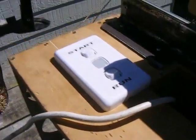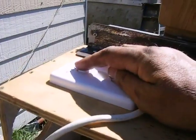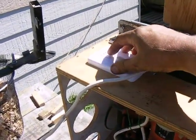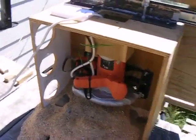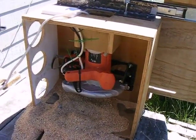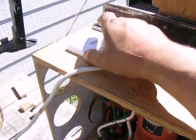What's inside this thing? Up here we've got a power switch — start and run. Because this is being powered by a two kilowatt inverter powered by the house battery system, it often causes the inverter to shut down. So at the moment I hit the start switch, you see a lamp in here come on — that's working as a soft start. So when you hit start, then hit run, you get a gentle start. It's just a skill saw like the one that cuts the wood out of the power pallets, set upside down in a box. The power switch is locked on with a couple of cable ties and the switching is brought out here instead.